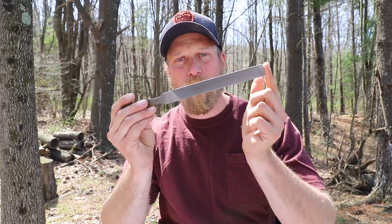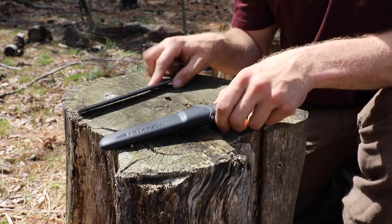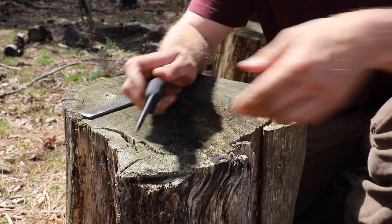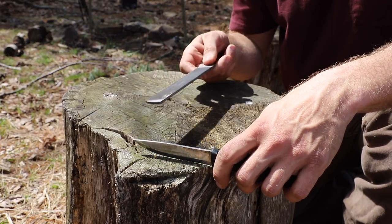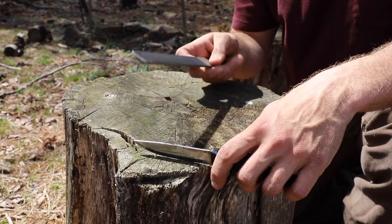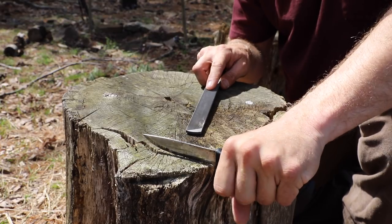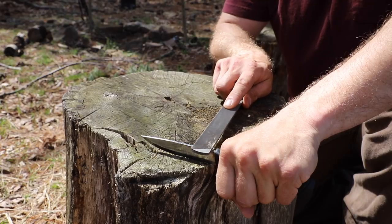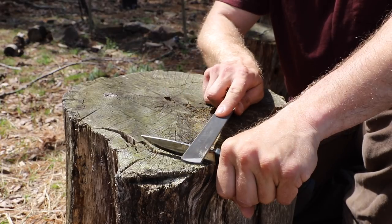If you don't have access to a belt grinder, what's the next best thing? A good old file. The file I'm using for this is my axe file, so we have a coarse and a fine side. This Mora Companion has already been squared off, but it's going to be good for demonstration to show you how we go about doing this. There is some time consumption to this, so it's not a very fast project. Start out with the coarser side of the file and place your knife on some type of log or stump that you're comfortable with — you can see how I'm holding this in place just like that.